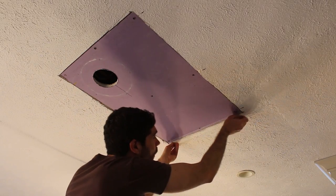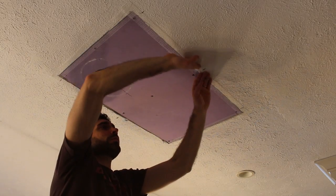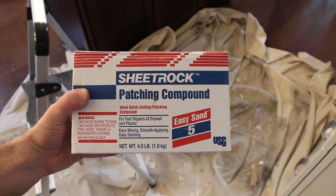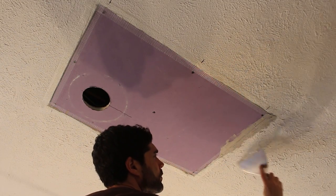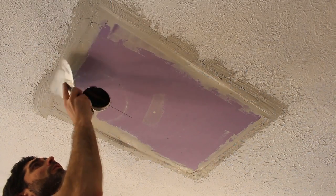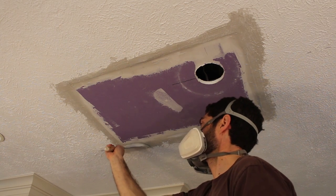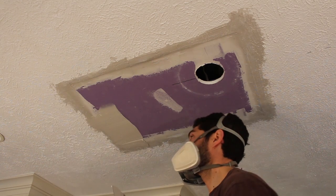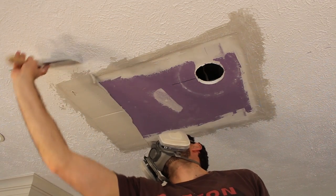The next step is to apply tape to the transition between the old drywall and the new drywall. I'm using mesh tape because paper tape will bubble up a little with the texture on my existing kitchen ceiling. Then I'm using Easy Sand 5 mixed to about a milkshake consistency — I use Easy Sand 5 because I want it to set up quickly so I can put multiple coats on in one day. I put a thin layer over the mesh tape and over the existing drywall screws, then after the 5 sets up I'm embedding Easy Sand 20 into the purple board to build it up so it meets the transition of the different drywall thicknesses.